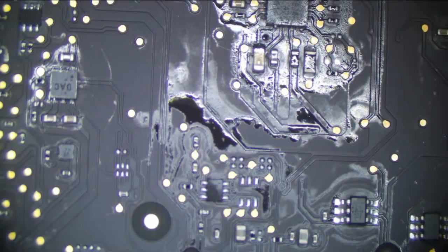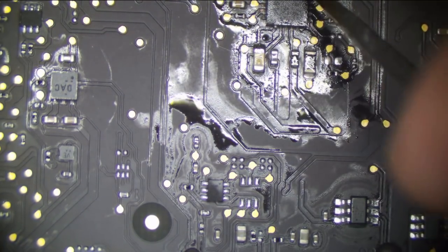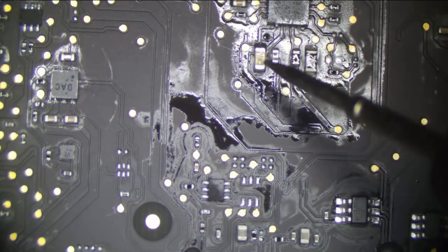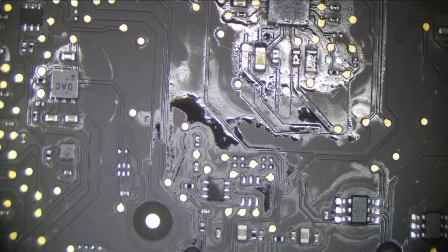Let's check resistance again right here. First, I'm going to clean this away. Get out of here. And we still have 130 ohms, which is still way too low. So more injecting voltage. We're going to see what else gets hot, because I think we have a compound issue here. And that's definitely what it seems like right now, given the fact that it is still not working.